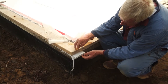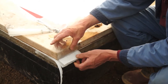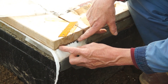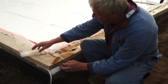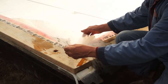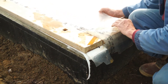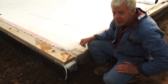What we have here is a preparation for the sill plate. Under the sill plate, we have two layers of typical foam gasket. On top of that, we have two layers of plastic with two beads of acoustic sealant. The purpose of the acoustic sealant is to create a true gasket preventing air penetration or airflow underneath the sill plate. One of the sheets will go below the concrete slab in this home, and the other will be the vapor barrier on the interior of the double stud wall. So basically we want to create a complete barrier for airflow to and from the outside of this home.